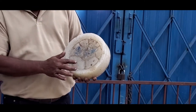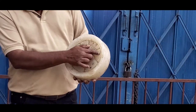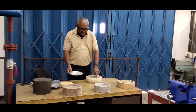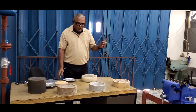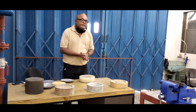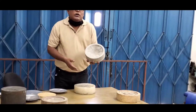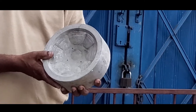So again, we have the petal, the bird, and the petal sitting on a steel pan here. We made an aluminum one from the wax one of the steel pan. We mold it in the foundry. We cast it, using a process called green sand mold, and we get this end product. This is aluminum. The end product is the steel pan here now.